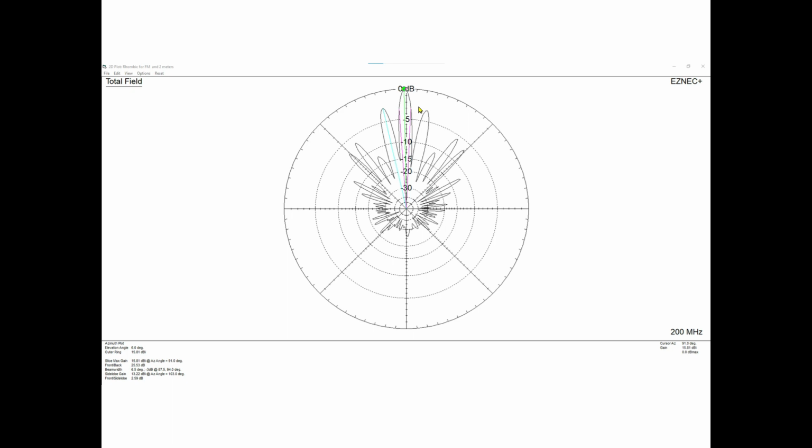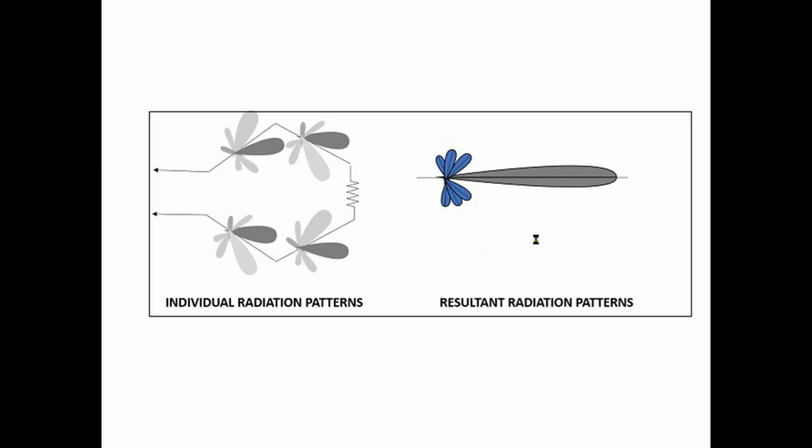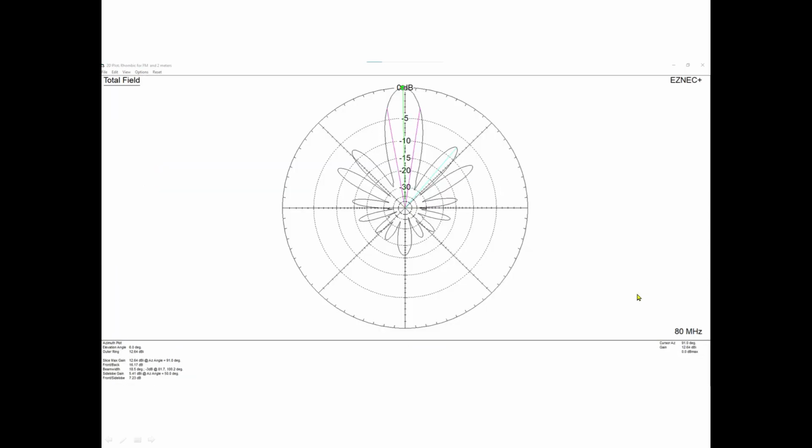Now, if you had taken those angles, went out to the antenna and made the antenna physically longer, right? If we go back here, sorry about all this running around, if we took these angles and we pulled them in like this, because we know the lobe that was here is now a lot closer to the end of the wire. If we stretched this and brought this closer in, then this pattern here would all come together. So that's pretty cool. But if you can look at that and go, wow, from 144 all the way down to 80 megahertz, I have a very good working antenna. Now,